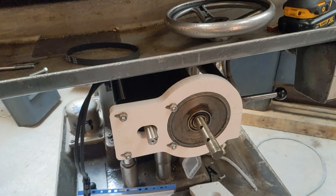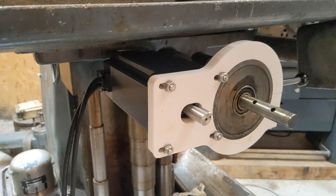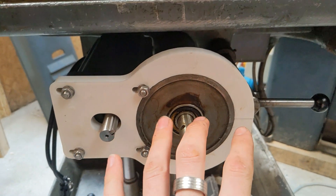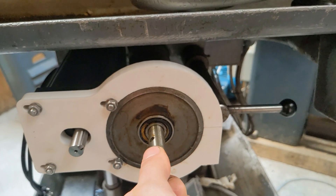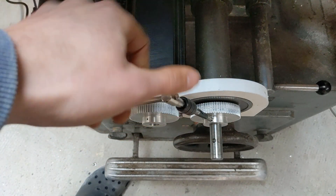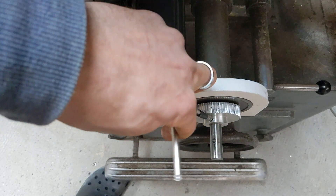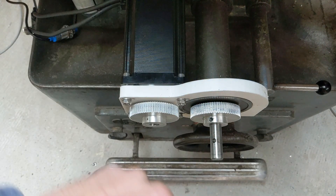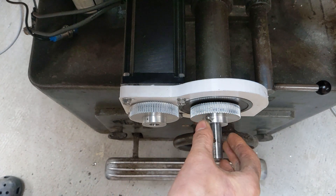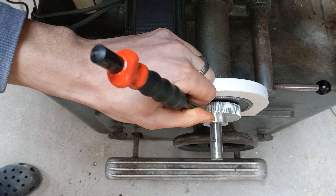That concludes the conversion of the X and Y axis hardware. The Z-axis was fairly easy in comparison — as all the force was acting downwards on the lead screw, there was very little backlash, so I didn't need to change it out for a ball screw. I mounted the stepper motor parallel to the drive axis and connected the two with a timing pulley. To mount the pulley to the shaft where the handle used to be, they used a tapered pin, so I machined a 5mm hole inside my pulley and used a tapered reamer to match the existing feature on the mill. This was my first ever time using a tapered reamer and it was really good — it left a very tight tolerance part because you can taper it in place with all parts in situ.